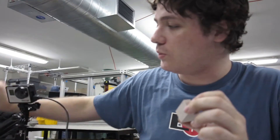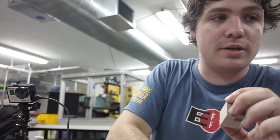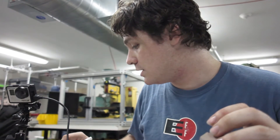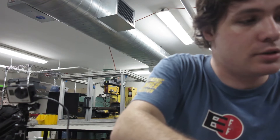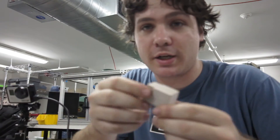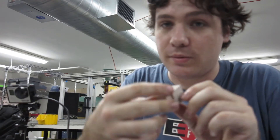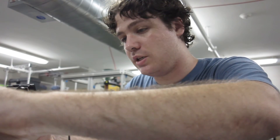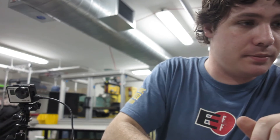So we're going to take our TLO from negative 2.2611 and make it negative 2.26625. Save the file. Now I'm going to take this block, flip it around to the unused side, put it in the PocketNC, tighten down the vise, save my tool table, and mill it again. We'll take another measurement and see if that fixed our TLO error.